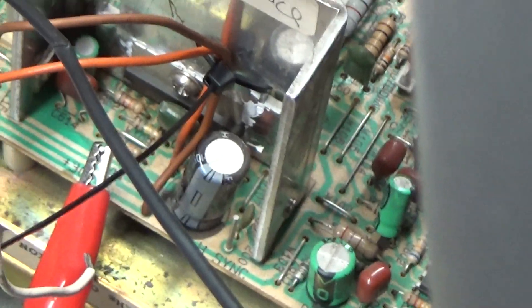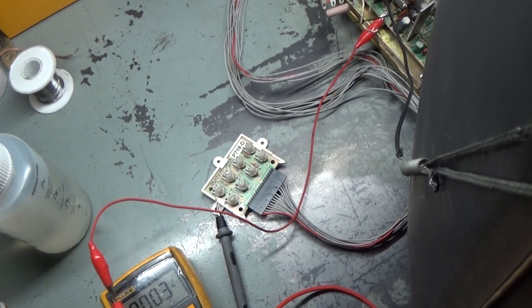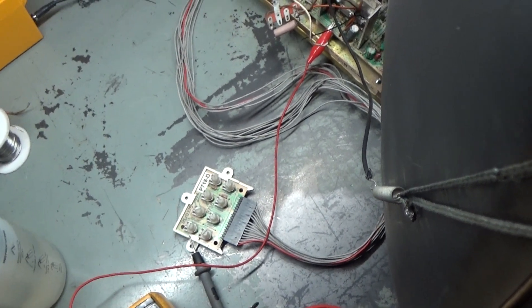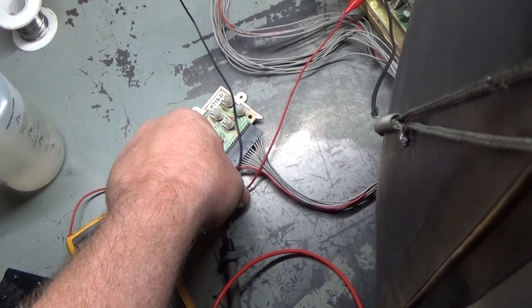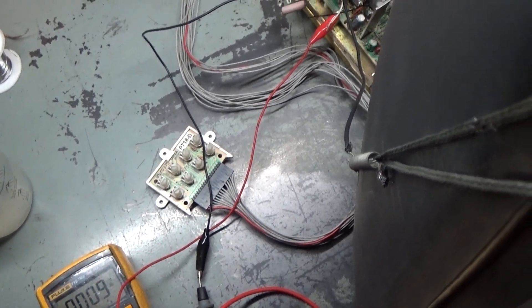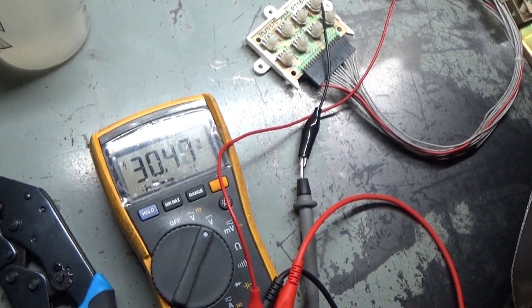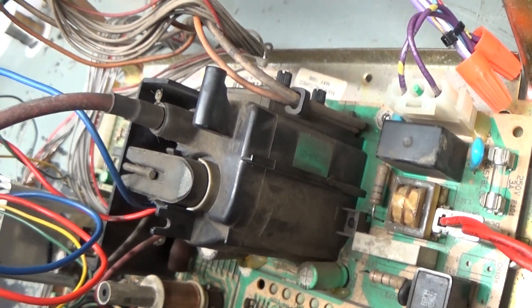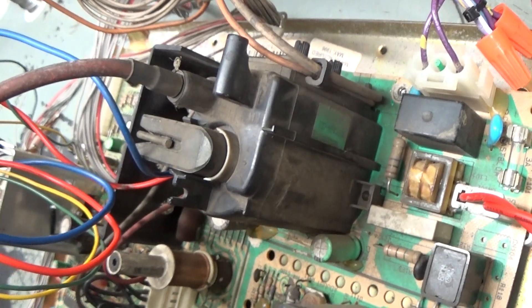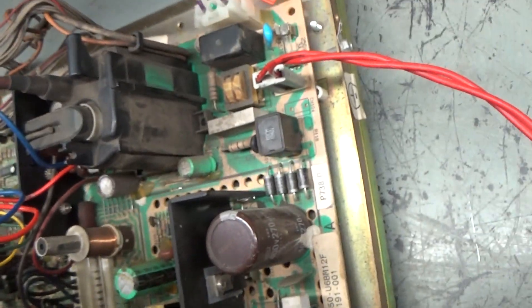I need to grab a couple of leads. The 25-volt reference is right here — on the U5000 you can see 'plus 30 volt,' which is our reference. It's supposed to be 30 but more like 25. I need to connect this to here and then a ground, which I've got right here. Let's turn this back on and see if we get our 25-volt reference. We got 30 volts, so we should have deflection — and we don't. But listen to that flyback. You can hear it ticking. I think the flyback is the problem and/or bad caps.